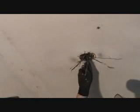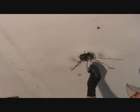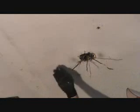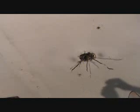So we know there's 3 sets of wires in there. One set going back to the electrical panel or wherever this power goes. And this power, I know, feeds the TV in the living room. So we know this one set of these wires goes that direction over there, and then that power feeds this. Then from the TV it goes over to the breaker. Okay, so I only care about which black and white wire is hot.